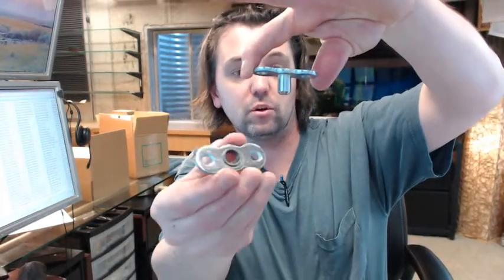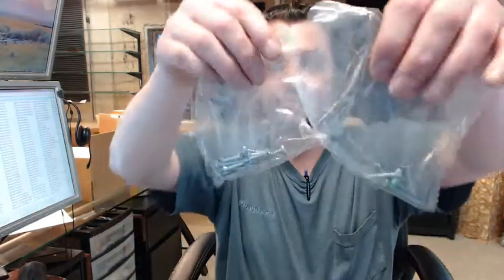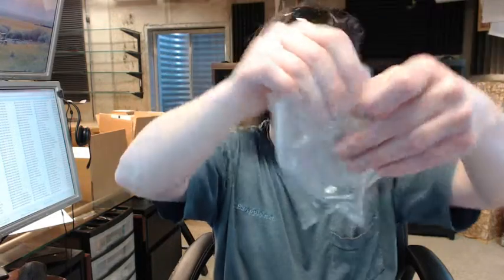Okay, you're going to get a heel plate, and I'll show you how that's going to work out in just a few. You're going to get your top pivot assembly, kind of going to look like that. Okay, header portion, your door portion. You're going to get a tension rod. That's for setting the spring tension. I'll show you that in a moment. You're going to get a whole mess of screws for attaching everything. Top pivot, bottom pivot, to the floor, everything. Unit to the door, of course.